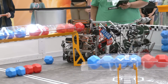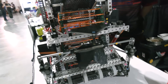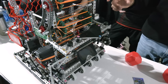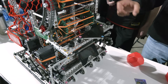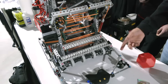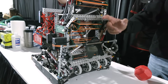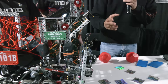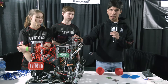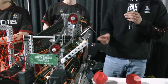Next I'll talk about the aligner. We have a one-piston aligner — it uses a 50-millimeter piston. This allows us to have more margin when scoring on the long goals. The cutout shape is cut perfectly to the shape of the long goals, and we want it to be really big for maximum margin, so to fit in size we put this piston on it. Also, to score in the middle goal we have to put it up. When we lift the aligner up, we have a standoff here that extends a little bit out the front of the robot. So when we've filled a goal with our balls and want to push them into the control zone, we can back up and ram into all the balls, and this standoff will push all of our colored balls into the control zone.